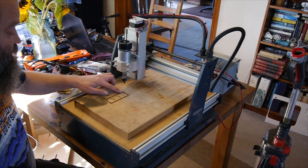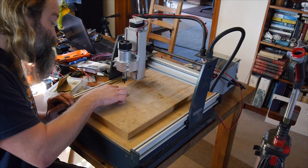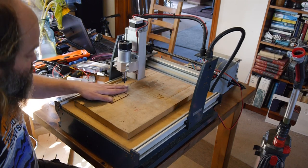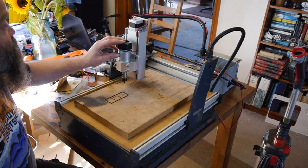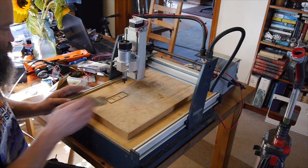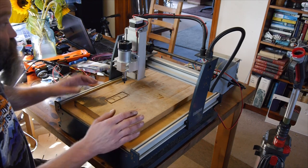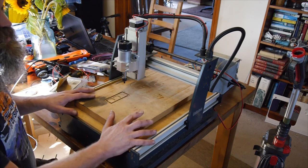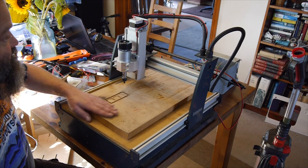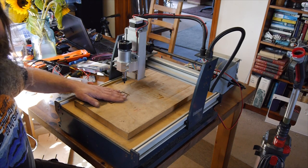So that's finished doing its thing and I'm quite pleased with that actually. It's not the ideal milling bit - it's a metalwork bit and it's very blunt, and it's scorched a little bit here and there - but it's not skipped any steps. We've got three shapes here milled to three different depths and it seemed to cope with it quite nicely. So yes, it's done everything I need it to do at this stage. A little bit more tweaking to do and I need to sort out the business with the end stops so that it can home properly, but that's just minor stuff. More majorly I need to find space in the workshop to put it, because the workshop's a mess at the moment. When it's in there we can chop some more stuff, make some proper mess, tweak it and make it do exactly what we want. So yes, that's been quite successful - we'll come back to this at a later date. In the meantime, thanks for watching.